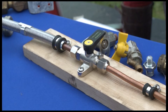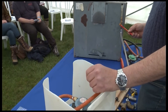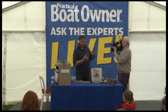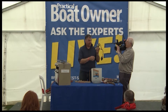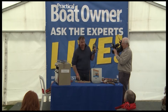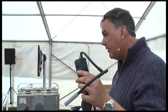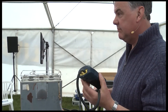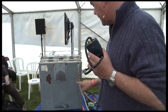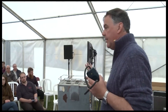So this is a nice-looking installation: clipped, quarter-turn valve, gas block in the gas locker, marine regulator, through to the cooker, and a test point. When I test, I use an electronic manometer. My initial test is done from the test point without the regulator on. I test down and I'm looking for absolutely zero drop. This manometer is accurate down to 0.1 of a millibar, which is 0.0015 of a PSI — about 20,000 times less than what's in your car tyre. I can then test by the test point back to the quarter-turn valve to check what drop I've got on the cooker. If the drop exceeds regulations, the cooker fails.